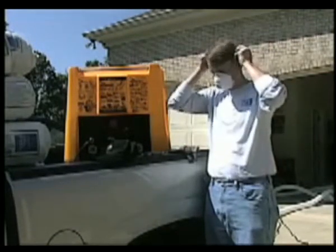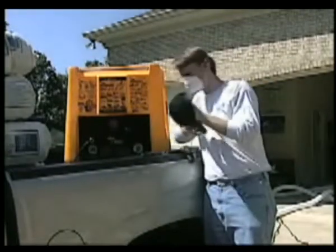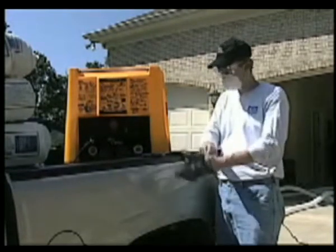Apply safety accessories. We recommend that safety glasses, gloves, long sleeves, pants, safety footwear, and a dust mask be worn. The person operating the hose should take it and the remote switch along the protected path in the house, through the access hole to the furthest point from the access hole in the attic.